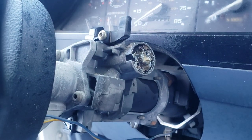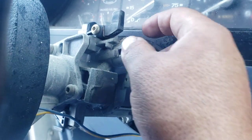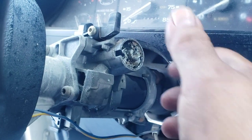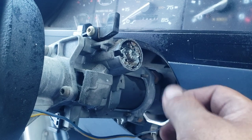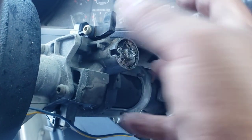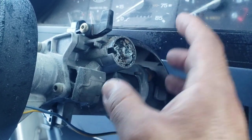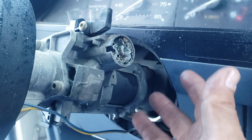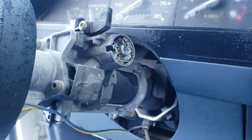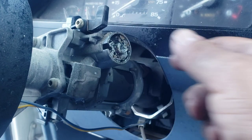I started with the drill bit halfway in and then it got stuck, so I pulled it out — I put the drill in reverse to pull it out. Because if you start twisting it and that kind of stuff, chances are you can break that drill bit in there and then you've got double trouble. So I put it in reverse and went the opposite way, pulling it out.